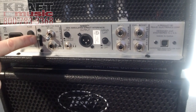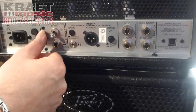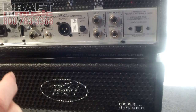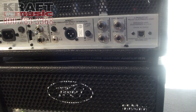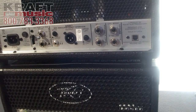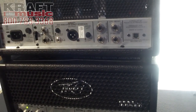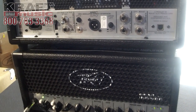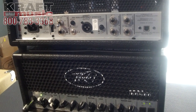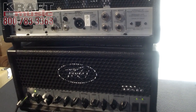A really great feature is the power level switch. You can switch from full power — 20 watts using the EL84s inside — down to 5 watts or 1 watt. It's not literally switching the power down; it's directing power to the internal load and sending less to the speaker cabinet, meaning you can drive the power stage harder to get that overdriven power valve sound — which is very different from the preamp valves — without ear-splitting volume. It's great for recording: you can sit in the control room, plug straight into your recording system, and record without producing too much volume. Good for all kinds of recording studios, but especially home studios. That's the 6505 MH.